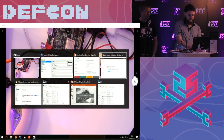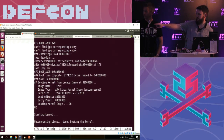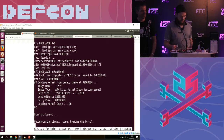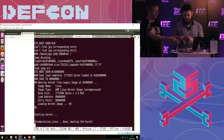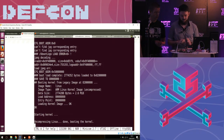The technique is called glitching. All we do when we're glitching is just short one of the data pins from the memory to ground. That stops the memory chip being read. And if you stop the memory chip being read at exactly the right moment in time, U-boot will stop because it can't load the kernel, and you'll get access to the console. The timing is a touch sensitive, so it may not work — but let's see what happens. So I've power cycled it, and I'm going to short the pin now.